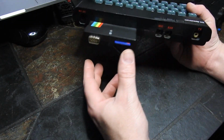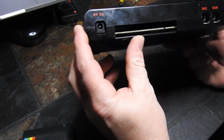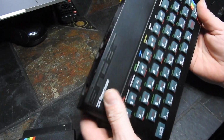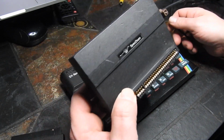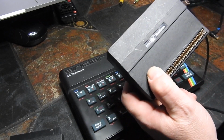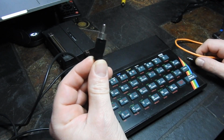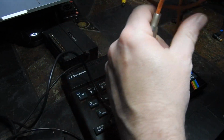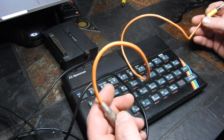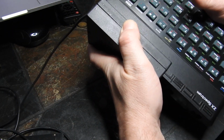So on the back of the unit, this is the SD card reader. This pulls out like that, and there we can see the edge connector where you would attach peripherals. And the Specdrum itself plugs into that edge connector, and it's quite a long cable now. Originally that ended up as a phono cable, and what I've done is just make another cable which is a female phono to bantam to plug into my patch bay, and the Specdrum plugs into the back like so.